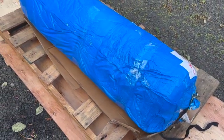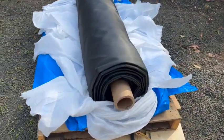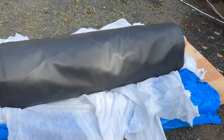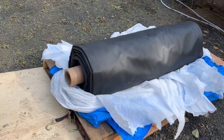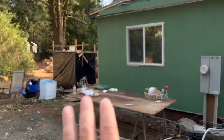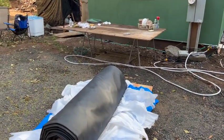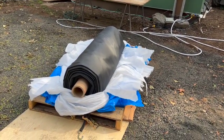We'll find out if it's really 100 feet when we get it unrolled up there. That's what your pond liner house cap looks like when it ships. I'm assuming it's doubled up — it needs to be 15 feet wide, and I'd say it's tripled up. To get it on the roof, I'll probably put a couple of metal bars through it, turn it sideways facing the house, build some little stilts to get it off the ground, so I can roll it and pull it up like a carpet.